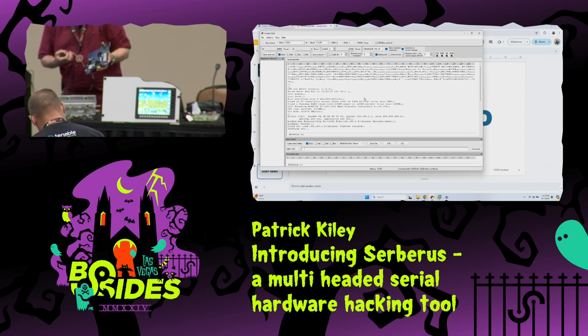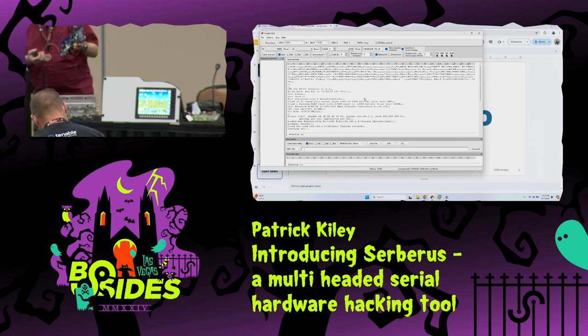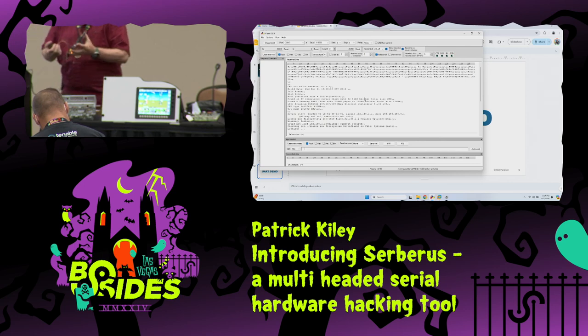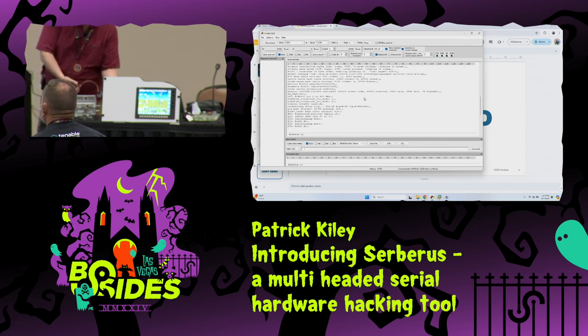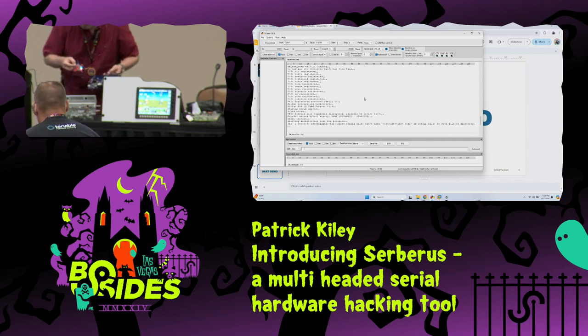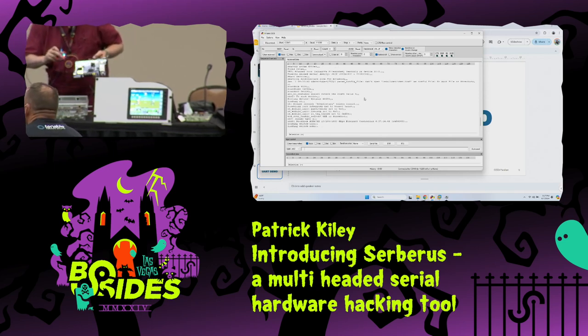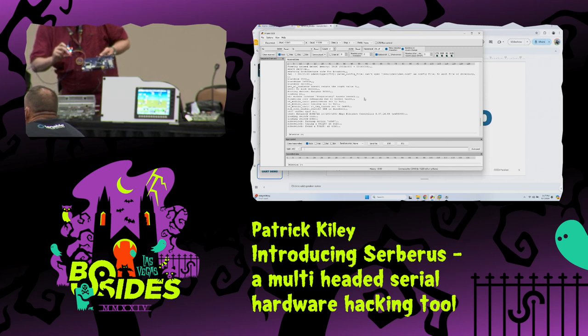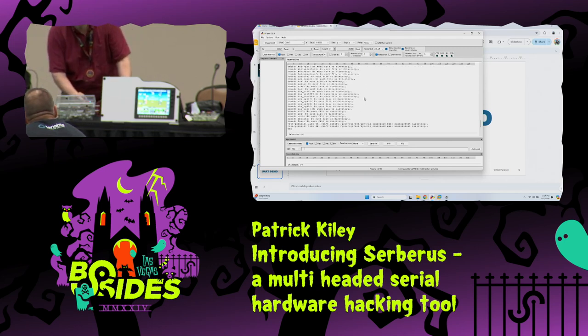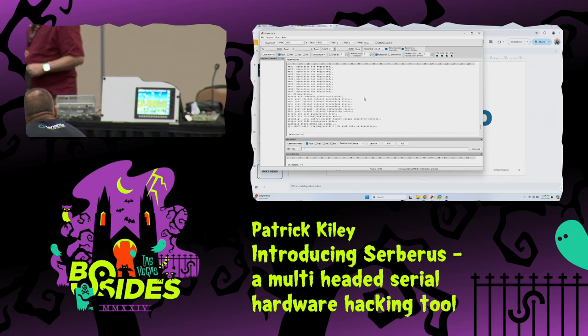I have it connected to the first UART. You can actually send and receive on this, but this particular device takes a really long time to boot. So I'm going to skip this and move back to the rest of the presentation. And if you look closer, you can actually see it flash. That's one of the indicator lights. That's a really good way to check and actually see if you have connectivity, is to verify the status of those indicator lights.